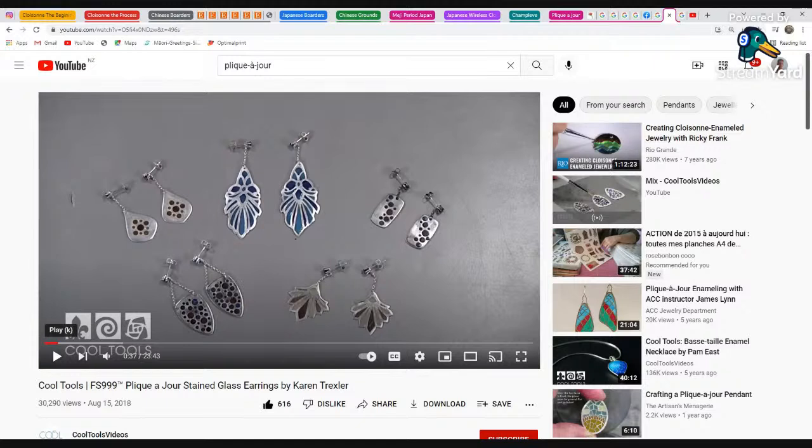It's a process called sintering, whereby it's a coalescing of powdered material that's turned into a solid by heating without liquefaction. So rather than getting a flattened piece of sterling or pure silver sheet, drilling that out, and then going through the process of plique-à-jour, she's actually using the silver clay, which is an extremely clever idea. So we'll go back to her.